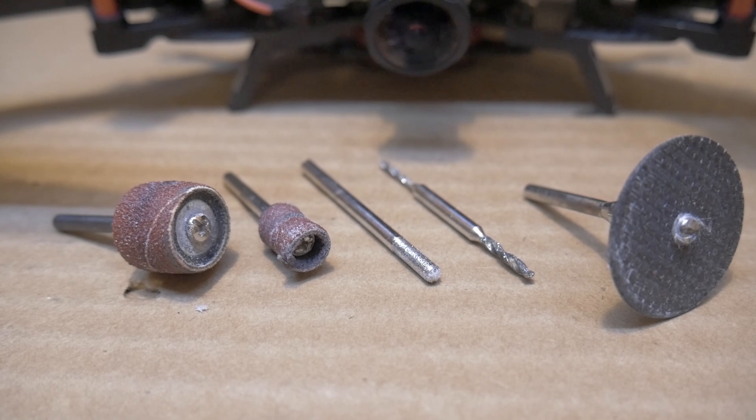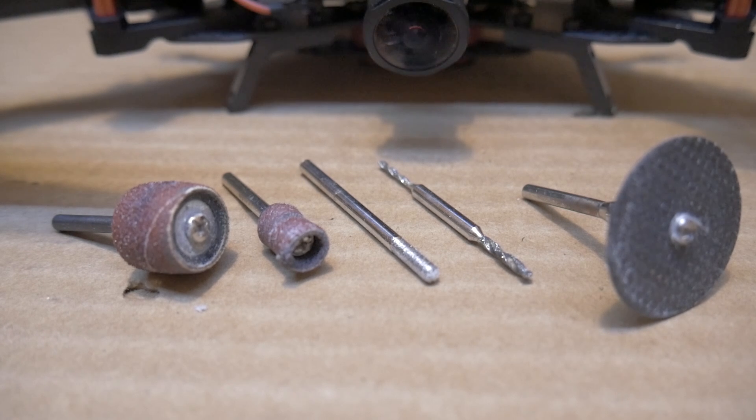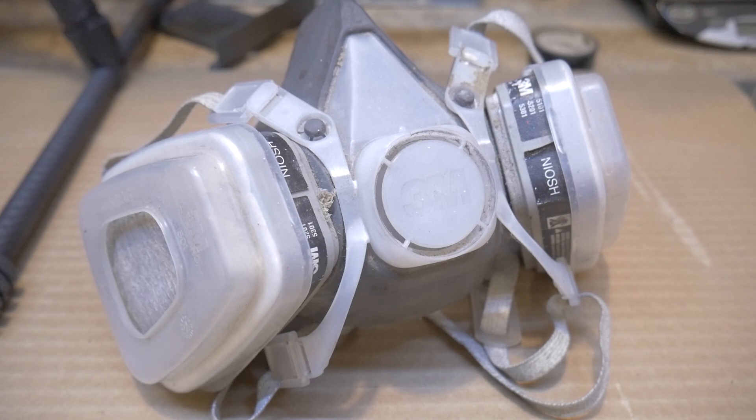That's also a side-cutting tool — I used that to make the holes just a little bit larger if I needed to. After drilling with the drill bit, I would use that to make the hole larger. The two sanding wheels on the left I used to make the curved edges a little smoother and look a little nicer, and then I would use sandpaper to clean everything else up. The carbon fiber plates I got off eBay — two of them for $40, and they were 200 by 300 by 1.5 millimeters. You definitely want to wear something to protect your lungs; you don't want that carbon fiber getting in there.